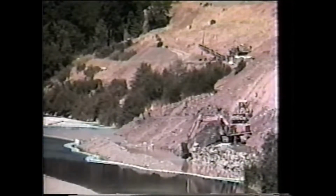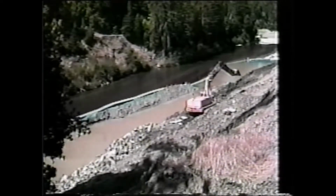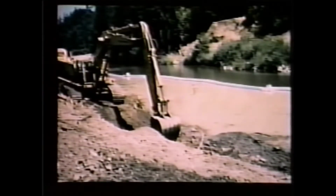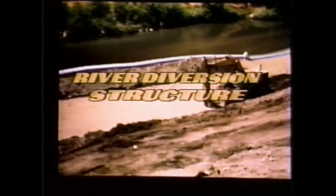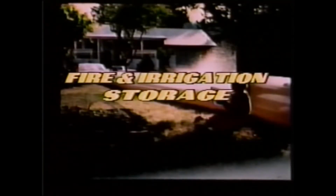Here are some examples where water structures were used effectively as an in-stream containment barrier for bank work along small and large streams. As a sediment check dam during road construction by the California State Department of Transportation. As a dewatering dike in place of sheet piles or earthen dikes to isolate work sites in channels or streams. As an in-stream diversion structure in place of earthen dikes or sandbags. As a temporary barrier to isolate work sites for channel crossings.